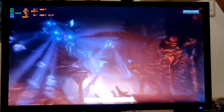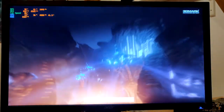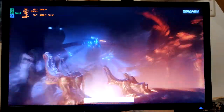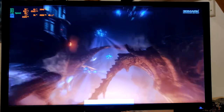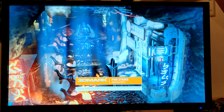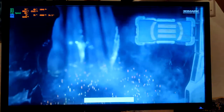Okay, it's starting to artifact a bit, which does make sense. When the memory system is under load, it does heat up. Our core is getting kinda hot right now. That core temp on that GPU is actually pretty close to what my 2080 Ti daily runs on. To be fair though, my 2080 Ti does have a 360 and a thick 280 rad, and I have also recently removed my tempered glass side panel, because I want better cooling.